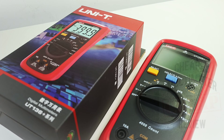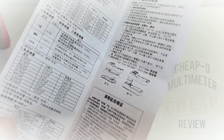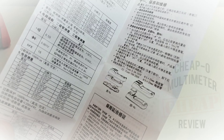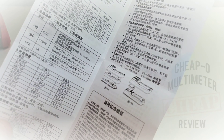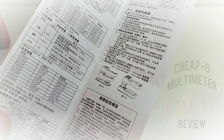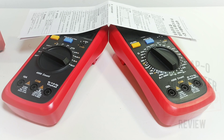This meter is light on extra stuff — it does not do temperature; that belongs to the 136C Plus. The 136B Plus is definitely a meter of fours. What do I mean? It's 4,000 count, threshold voltage minimum is 400 millivolts, goes up to 40 megaohm, and in terms of capacitance, you guessed it, 40 millifarad.